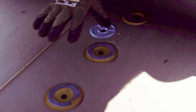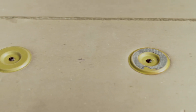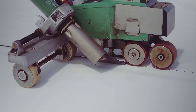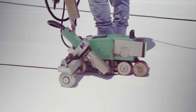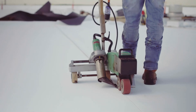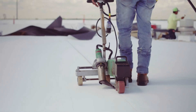That is the temperature you need to be set at for proper adhesion. This is a seam welding robot — it's self-propelled and it heats the TPO membrane up to a high temperature, then rolls a weighted wheel over the seam so that it presses the membrane together and welds it solid. This prevents water from being able to leak through the seams and creates a super strong bond.